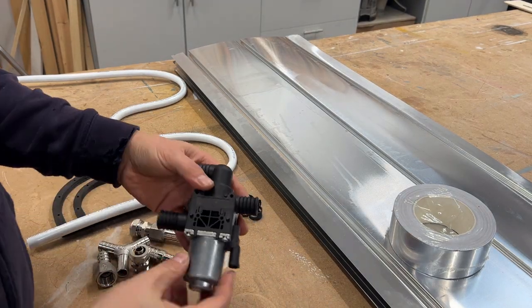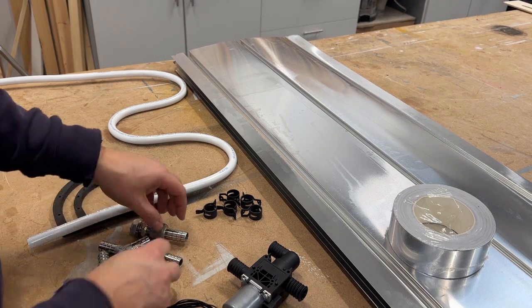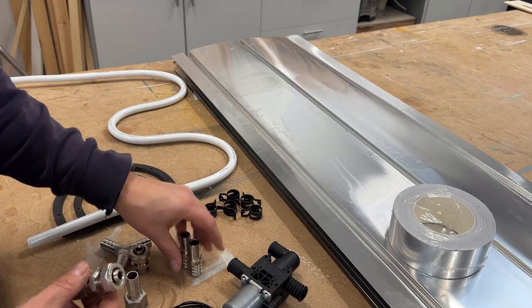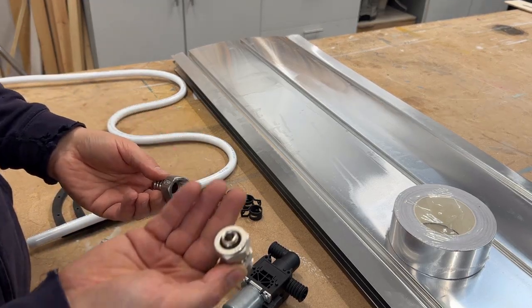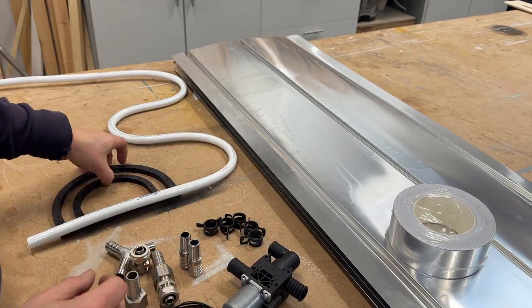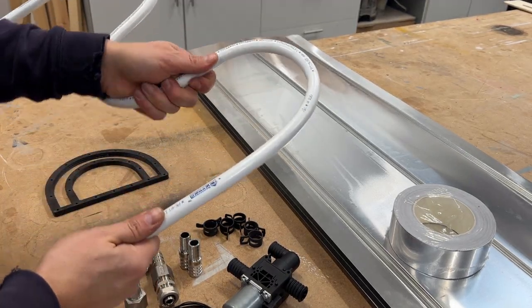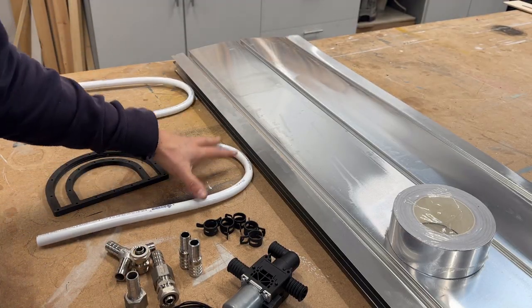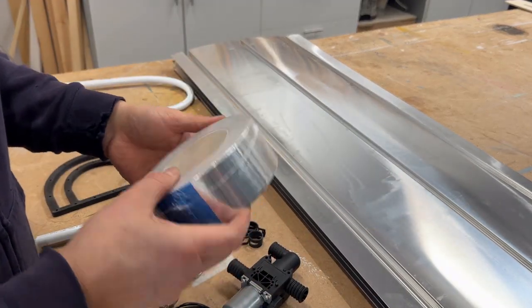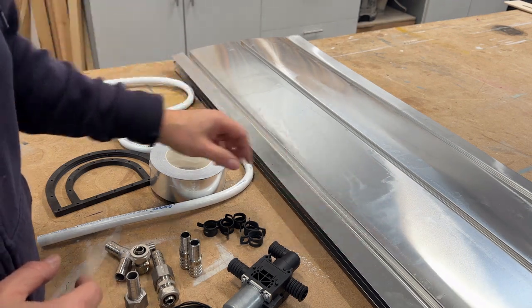So I'll just show you what you get in the kit. You get your diverter valve to divert the coolant through the underfloor heating pipes and a temperature sensor, a series of stainless steel fittings — some to connect to the pipe you've already got on the hydronic system, some to connect to the underfloor heating, and that just screws together, nice and simple. Hose clamps, a router template to help you with the grooves under the floor, some nice flexible underfloor heating pipe — the amount depends on the kit you've ordered — some foil tape to tape it all together and spreader plates, which again depends on what size kit you've ordered.